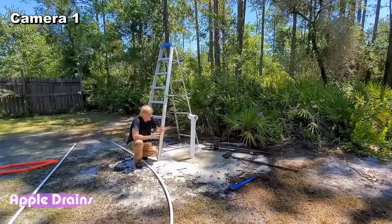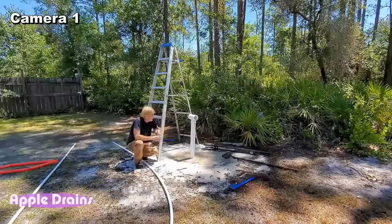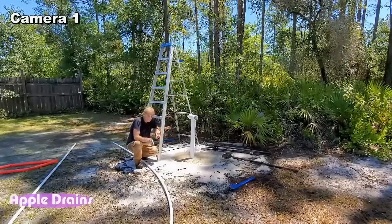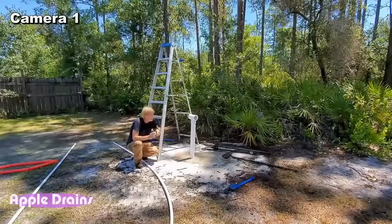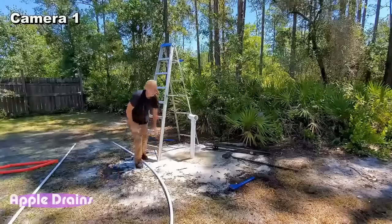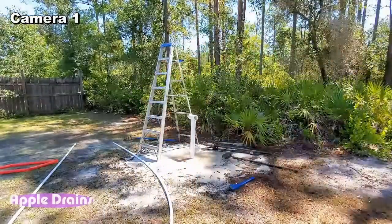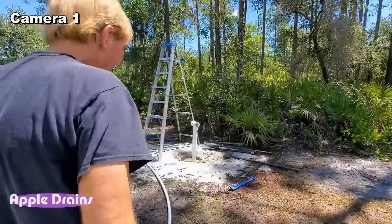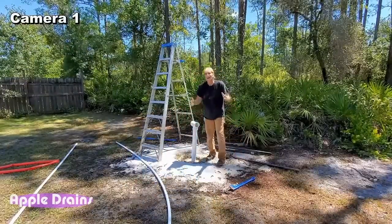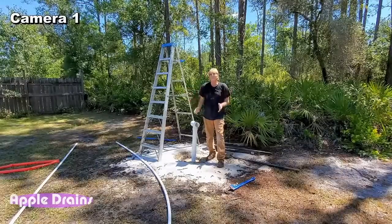Okay, I think I'm good. That's almost 20 feet. I'm gonna go ahead and cut it off, and then we're gonna do it again and sink this down, quickly pull it out, and sink in our suction, our well point. Give me a minute. I apologize for the delays.